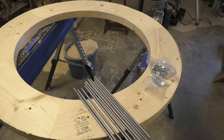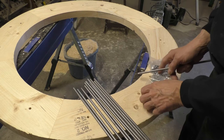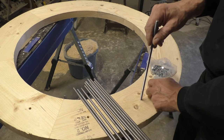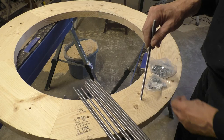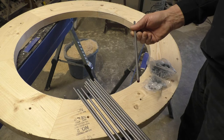Okay, now we can start getting rolling on putting these rings together in the stack. Originally I was just thinking of using these for alignment holes and possibly drilling them larger and putting some dowels through them after they're done. I don't know if that's necessary for anything, but decided to use these 5/16 threaded rods. They were 2 foot long, so I just cut them in half to give me a 12 inch piece. And then we're gonna assemble these with a washer and a nut on them,